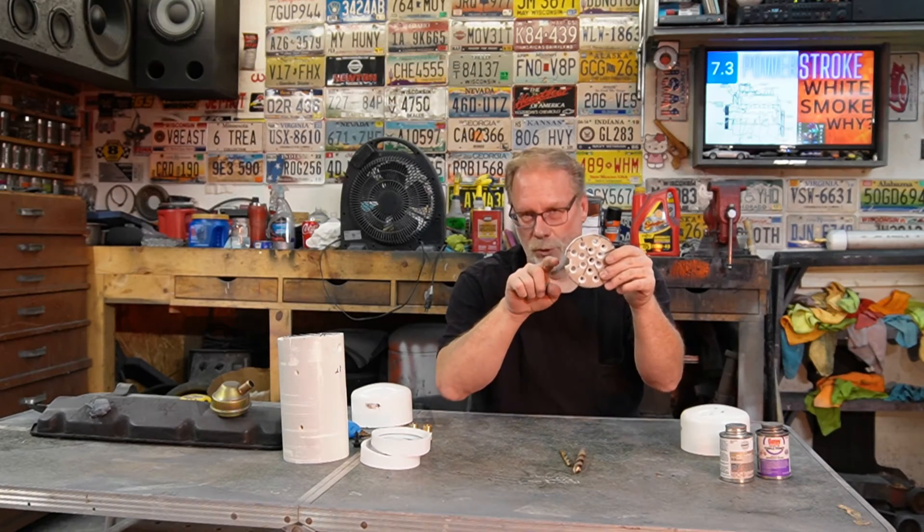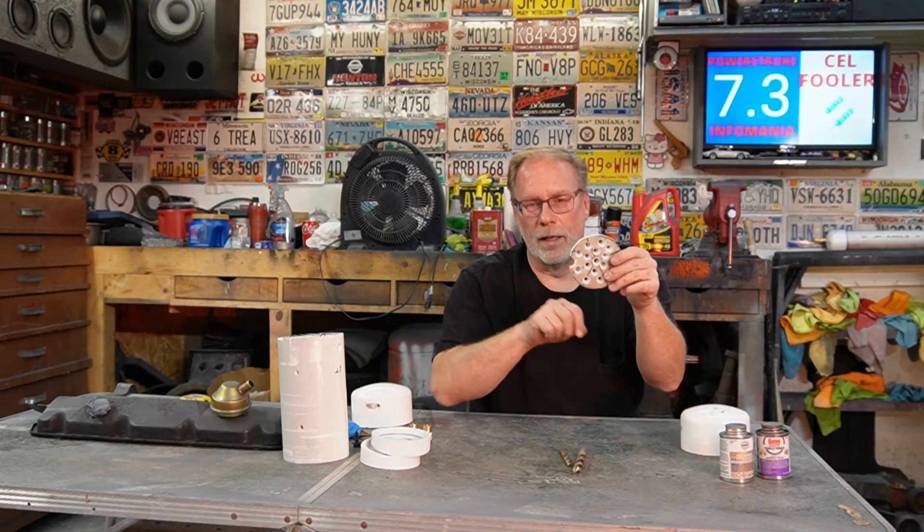Very little vapor will actually end up going through the hole. On one side here we want to make sure that we put a little drip-back — just a small C-shape like that. The number of holes I have here is 16 holes. We don't want to go beyond that and we don't want to be less than that — so 16 holes.